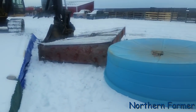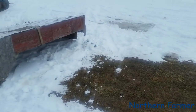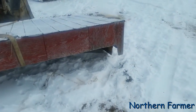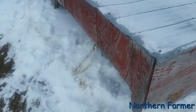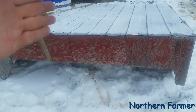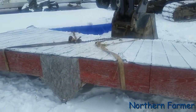Here's the roof section of one of these old sheds — one of our original ones that we bought. I had a comment on Instagram asking where we get the plans. What I did was when we bought these, we just copied them. They're pretty simple. To get the slope of the roof, all the guy did was put a two-by-eight and a two-by-six — I have to go under there to see which order — and then you just put your two-by-fours down and you get your slope.